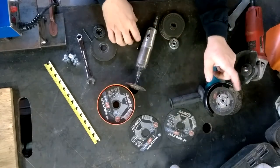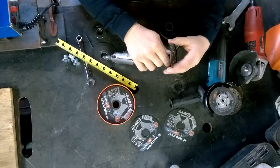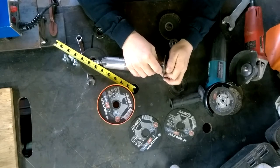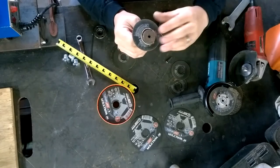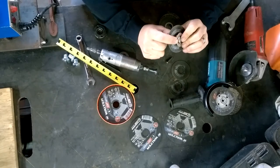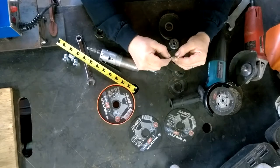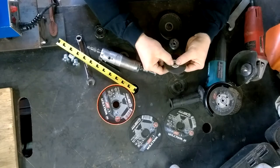And then once that's worn down, I'll wear it down to about 3 inches — this one is just at 3 inches. Then I'll get my third life out of it with this contraption. It's a little bootleg right now; I'm going to turn something on the lathe so I have fewer parts to deal with. Right now I'm using 3 washers: a really thin brass washer that floats on top and safely grips the cutoff wheel, and another washer that's slightly thicker, with just enough shoulder that protrudes into the cutoff wheel to keep it centered.